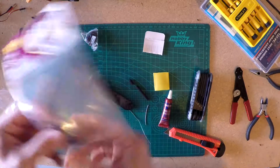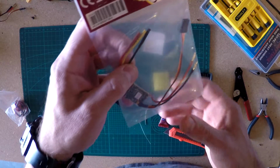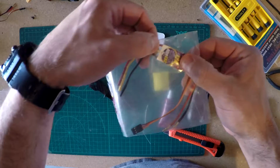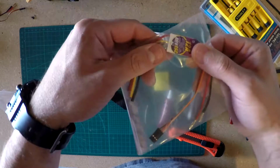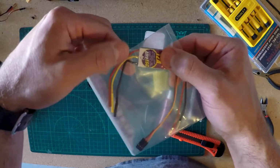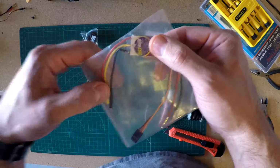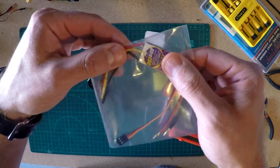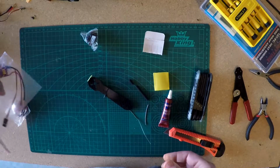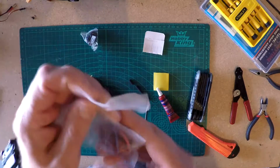One of the things they said is when you go to hook up your ESC, which is, correct me if I'm mistaken, somebody who knows more, electronic speed control, all you do is you swap 2 wires. So I'm trying to flip it over. I didn't see anybody do that. Everyone seemed to just cross 2 wires, but every single video I've watched said if you cross 2 wires, it doesn't matter which 2, it will change it from going clockwise to counterclockwise or vice versa. So I'm just mounting it upside down because that should be the black and the red being reversed. Hopefully I don't blow stuff up, but things are cheap enough, and I have enough time to go back and redo it if that's the case.